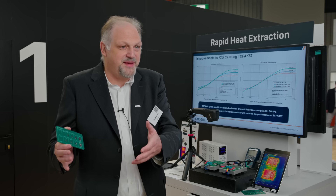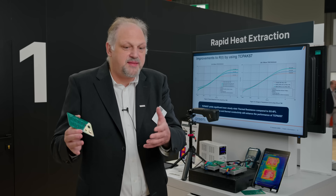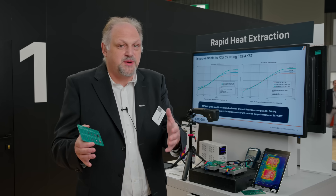You always need to work on the dV/dTs in time. Normally when you do your design, you focus on losses — you make switching as fast as you can and get great losses. Then you finish the design, it goes into the EMI chamber, and you fail EMI testing. At that point you're already six months from release, in deep trouble, and you need to redesign. Please start thinking about these things earlier.